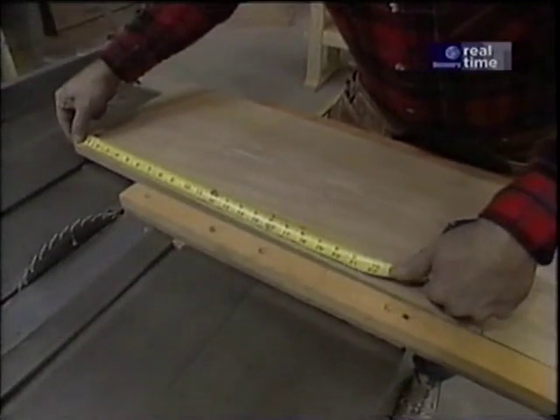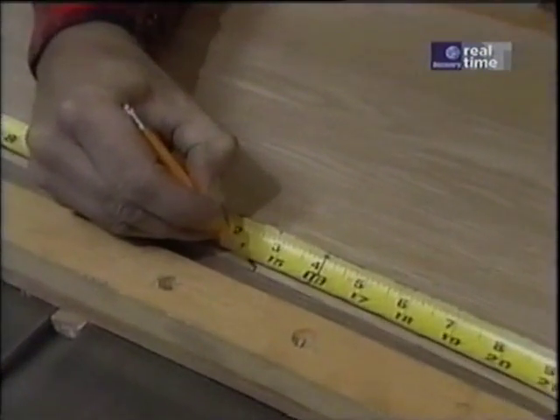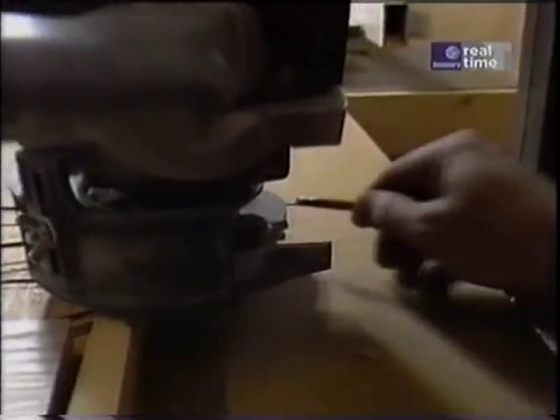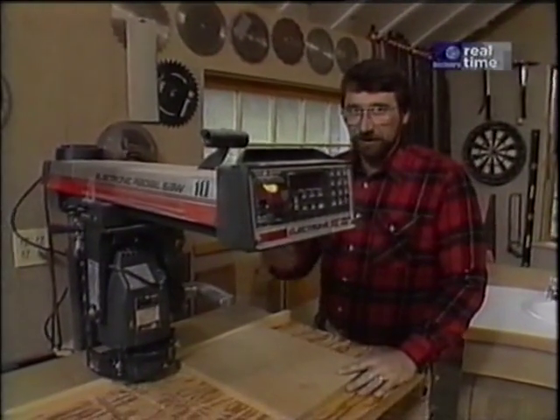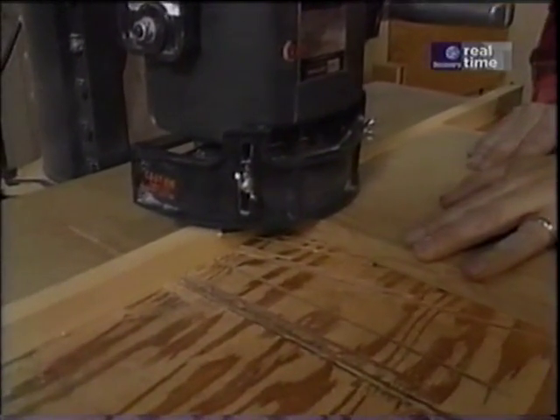With my tape hooked on that freshly squared end, I know the length of my panel is to be fourteen and thirteen-sixteenths. Let's take another look at our dry sink and see the raised panel detail on the inside of the door. To cut that, I'm going to use my radial arm saw with a molding head cutter mounted in place of the regular saw blade — it's just a heavy wheel with three cutters which spinning around will remove material. I'm going to do the raised panel in two passes, especially with this hard oak — it's too much material to take out at once. So we'll make one pass, make an adjustment, and do the second, always doing the end grain first to minimize splintering.